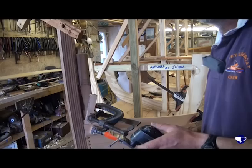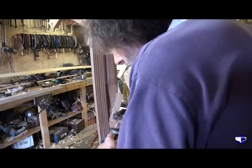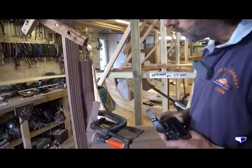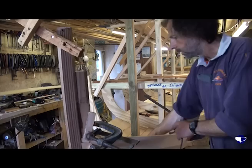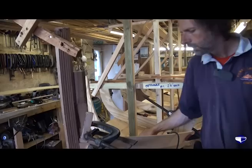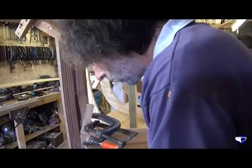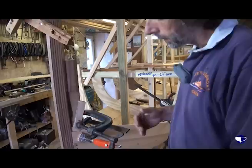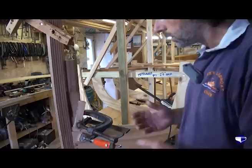I just need a new blade. We obviously have to be careful not to go too deep — we just need to go deep enough to cut away the timber but not to put a big saw cut into the stem. So another tap forward and another pass with the saw. We're getting close to having a good fit. The alternative is to take the plank off, shave away with a plane or a chisel, put it back, try it again — on and off, on and off. So the saw cuts the time down by at least half.